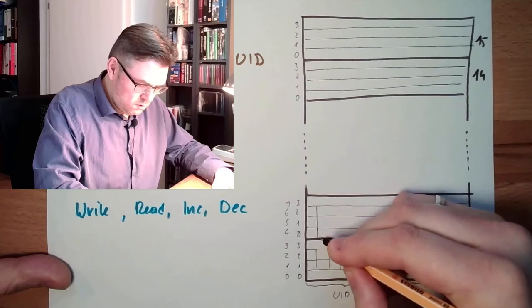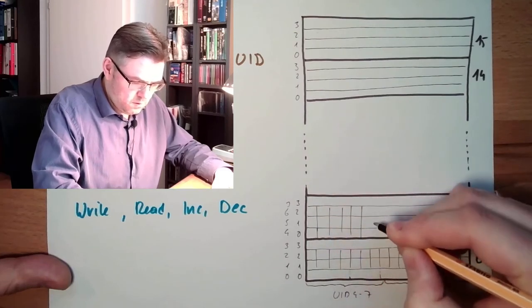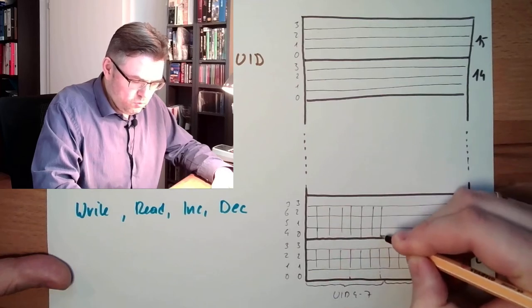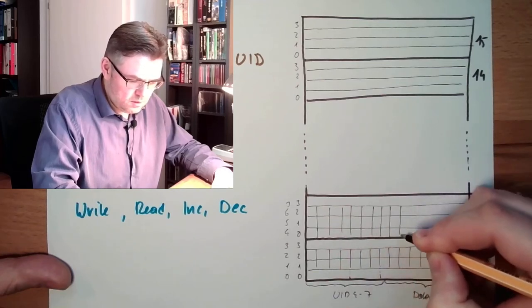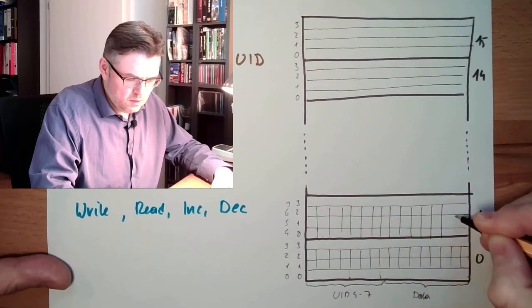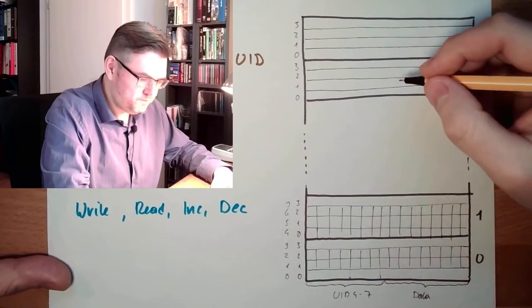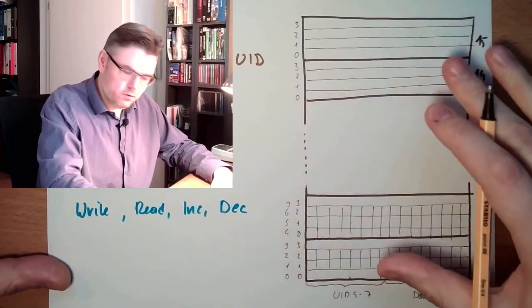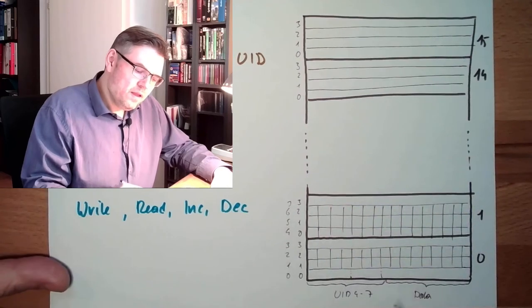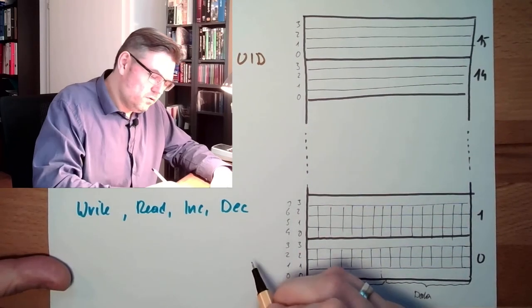So these are user bytes. We can use them as we want. If the UID is changeable or not depends a little bit on the card. This I will not draw up here. The last block of a sector is the so-called trailer.